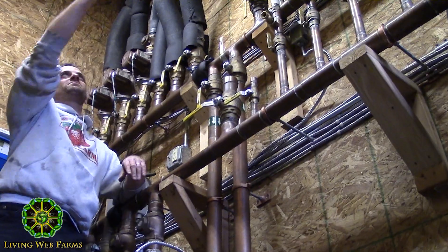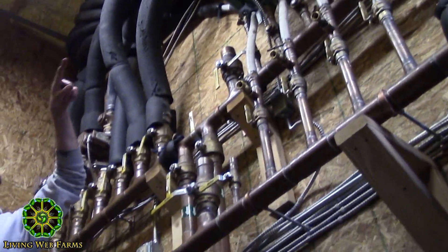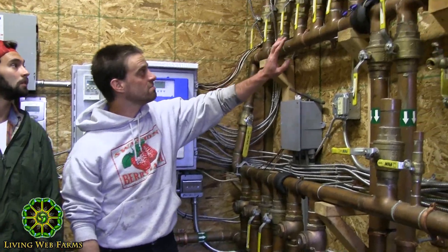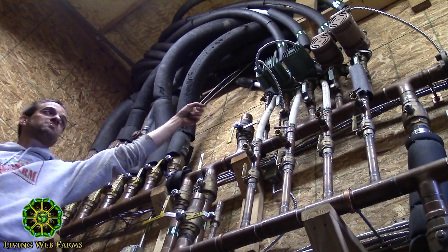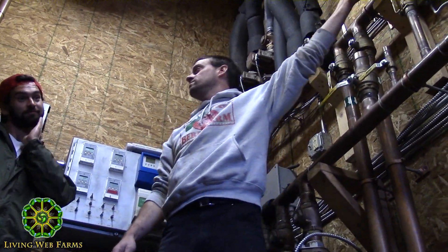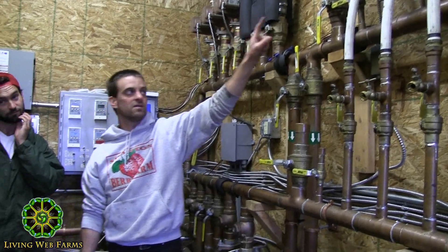These are our pipes interacting with our heat sources outside — the heat exchangers and the condenser being heat sources. Water is coming in anywhere between tank temperature and 140–150 degrees. During a heavy burst we can be pulling in water at around 150 degrees or so. They come in down here, enter this big loop, and off of this loop we can direct heat out to loads. These are all kiln heaters — the air heaters that Abraham was explaining. Or we can direct off to this future heating setup for the alcohol production we'll be doing here later this summer.